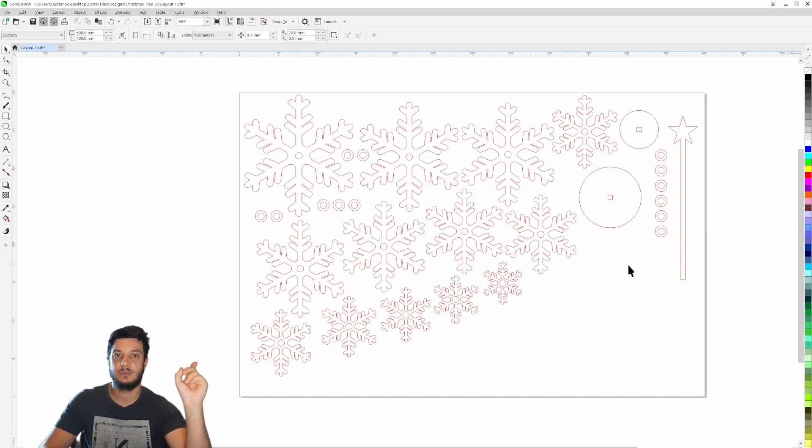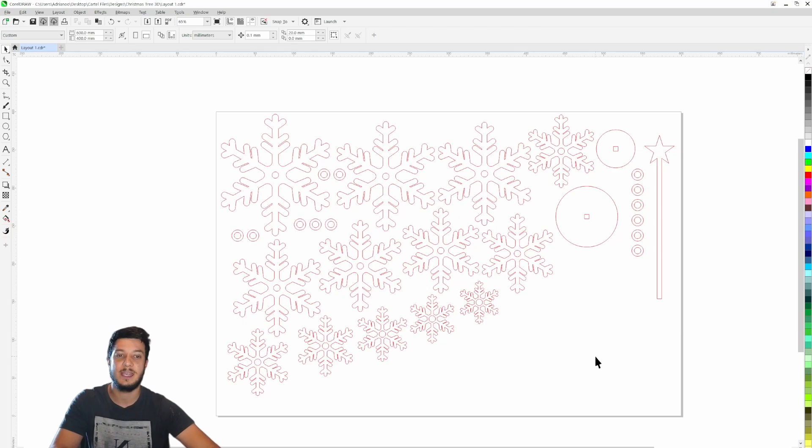Most people would just run their machine with this as the design file, and there's nothing wrong with that. But if you are mass producing these parts — say you need to make a hundred or a thousand of them — all this wasted space costs you money. It creates a larger cost base for your product, meaning your product costs more to produce, which results in a more expensive product for the customer. The better you can utilize your material, the lower your production cost and the higher your potential profit margin.